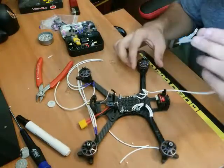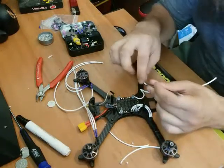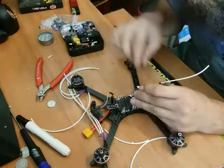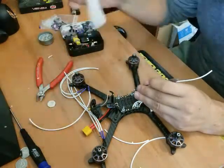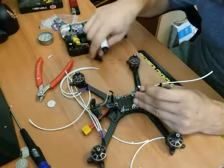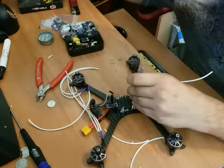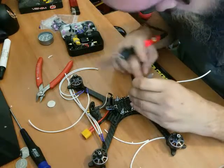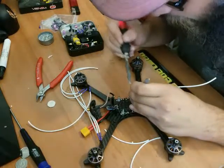Now these little guys, click up. I'm using, what is this, 18 gauge wire. I had to extend my motor wire, so I'm using 18 gauge for that because that's what I have around. Make sure it looks nice and neat. I gotta grab more towards the tip. And make sure I have lots of flux everywhere, flux everywhere. Flux makes soldering 10 times easier. Push that down. Maybe a little more right to the tip of the tweezers. Here we are. Push it down a little more.